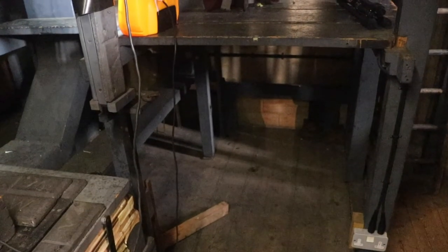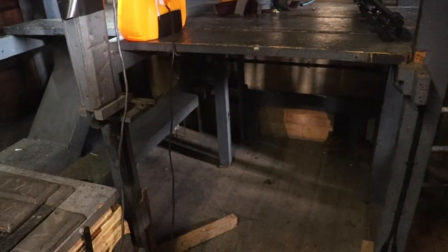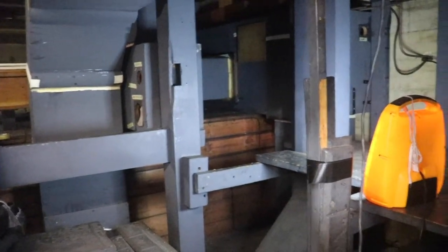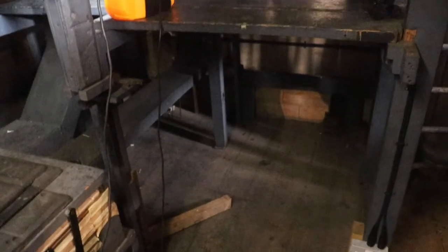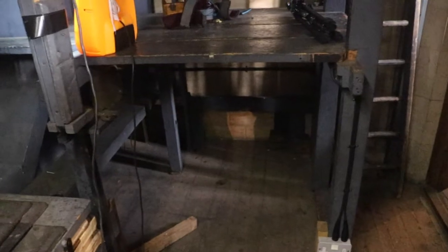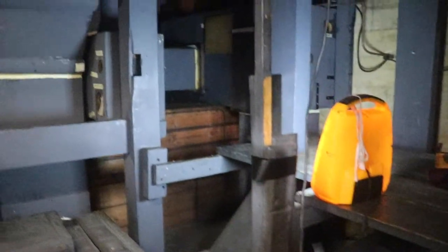Presently, the blower for the organ is down in a cellar right underneath the church, and this cold and dirty air is sucked in and then comes up into the organ through a trunk. That blower is at the end of its life, and we are briefed to replace that with a new one, which we are going to be bringing into the organ in a very soundproofed cabinet. And there's a perfect space for it here. And so we obviously have to take careful measurements to make sure that the new blower fits, and to work out how it's going to be trunked into the rest of the wind system.